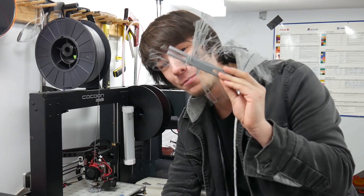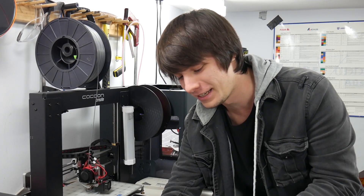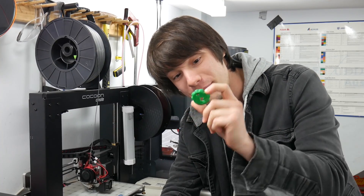I've got the Maker Coin printing in the Matterhackers silver-grey ABS and it's sticking down. It just comes down to that first layer surface area, which makes all the difference. If I was going to do the Wolpenator again I would put some brims on it — maybe four outlines to stick those very thin walls down, because it's pretty challenging. The only printer I've ever gotten that to work on without brims was the Cubicon Single, because it has a heated chamber, and that's what you really need to print ABS. But it printed the PLA beautifully.